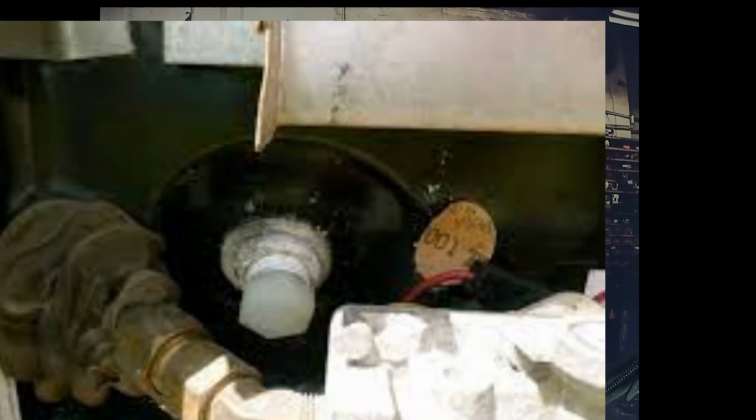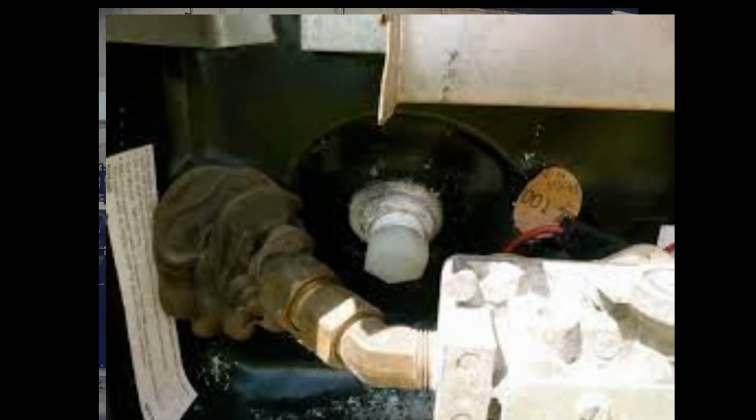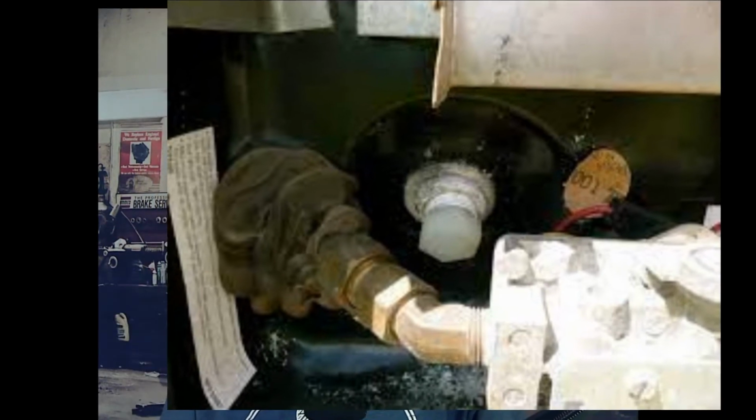So then the water heater's got a drain plug on it, so I take that drain plug out in the winter as well. Well, I put it back in, and I forgot to put any pipe thread sealer on it, pipe sealer, pipe tape, whatever you want. I use a liquid kind, but you can use either kind. I'll show a picture of that plug too. So I put that in there, and then it was leaking. So I had the water heater running, and everything's pressurized now. Drip, drip, drip, drip. Of course, it won't tighten up. It needs a plastic plug anyway. So I'm like, well, shoot, I gotta take that back out.